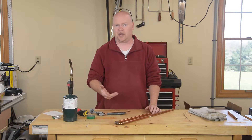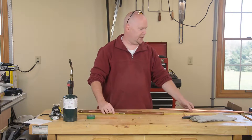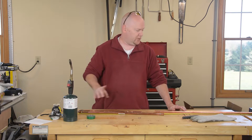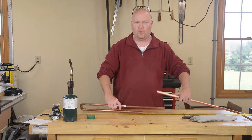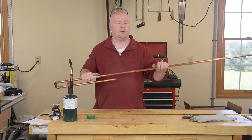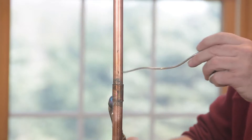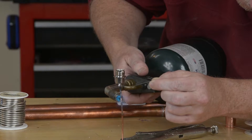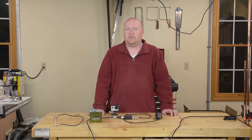Tuning lower is probably the direction I want to go, since the simplex frequencies are all at the bottom of the two-meter band. For my long top section, I know exactly how long I want it: 147.4 centimeters. Rather than cutting first, I'm going to solder it in first and then cut it to length — that avoids any uncertainty about how far it seats or thermal expansion. Heating up the copper and letting the heat flow up into the connector works great.